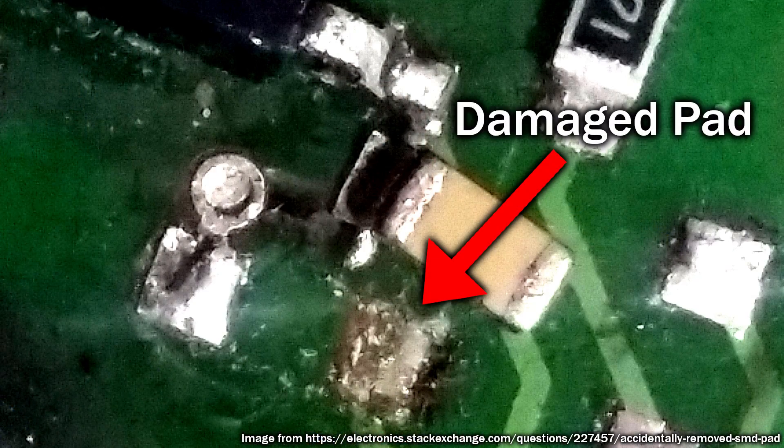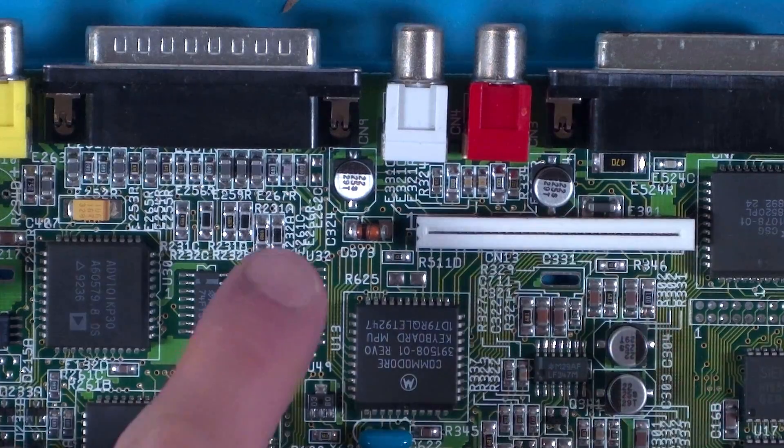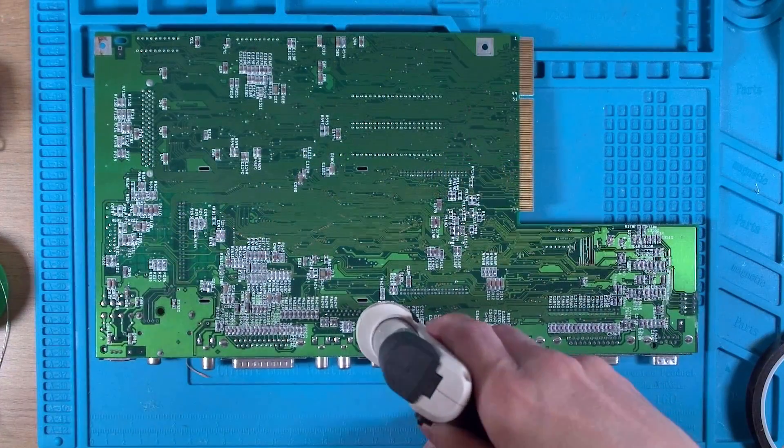There are several methods for removing surface mount capacitors from the PCB, each with their own issues. These range from simply twisting them off the board — a method I don't recommend as you're almost guaranteed to damage the pads underneath — to snipping the capacitors at the base and then desoldering each side. Some people really hate this method, but I don't see anything wrong with it as long as you clean up the board afterwards to make sure there's no electrolyte left. However, I'm going for a third option: gently heating the pads with a heat gun until the capacitor becomes loose. This has issues too, from the potential of the capacitor exploding, to overheating or burning the PCB, or melting the surrounding plastics.